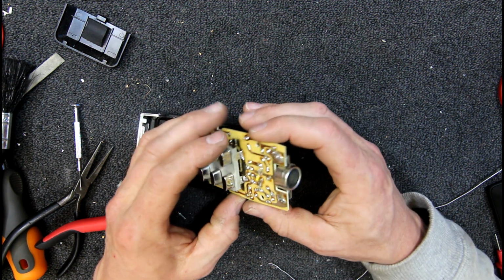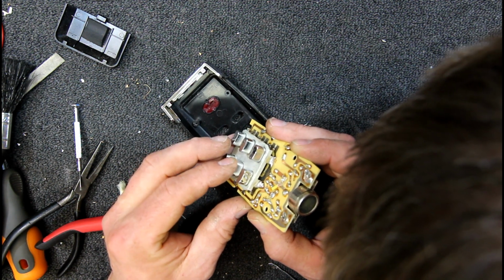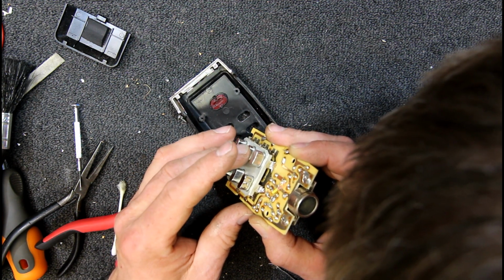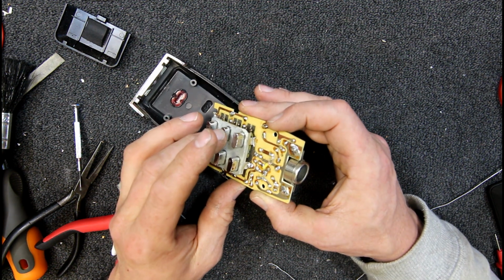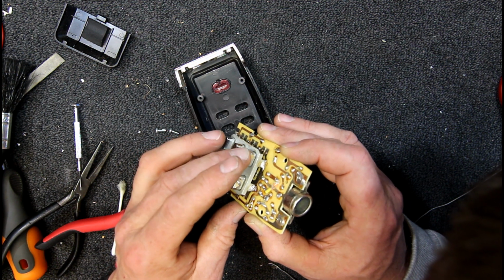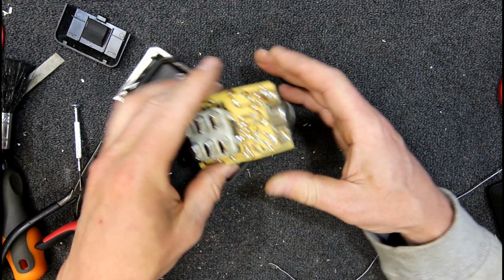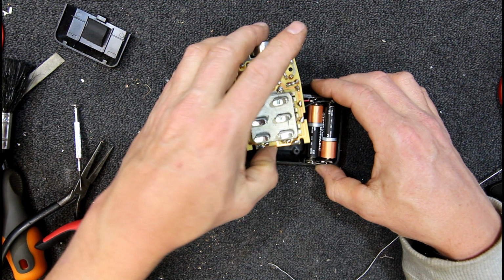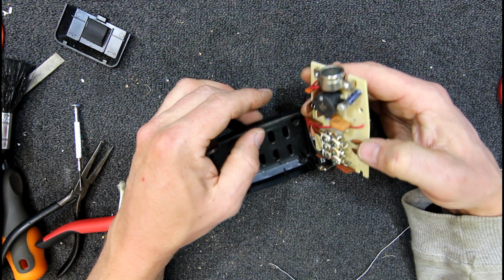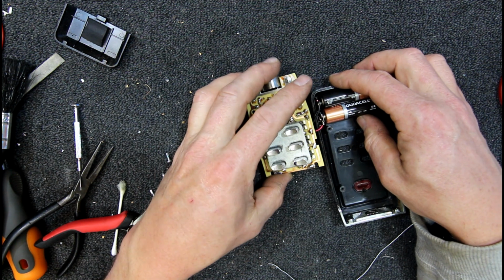Funny thing is, I think I can actually hear that. Yeah, I can actually hear the ultrasonic, possibly when those contacts are doing a bad thing, you can hear the ultrasonic make a sort of squishy sound. So I think that's working. Sounds a bit like squishing something, so maybe that fast pulsing on and off of a faulty button is a good way to test them.